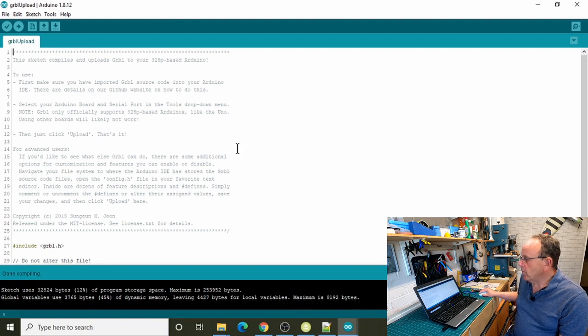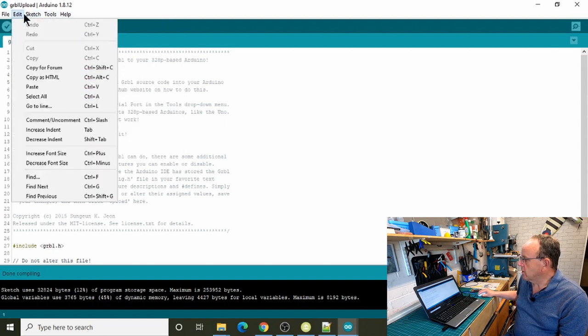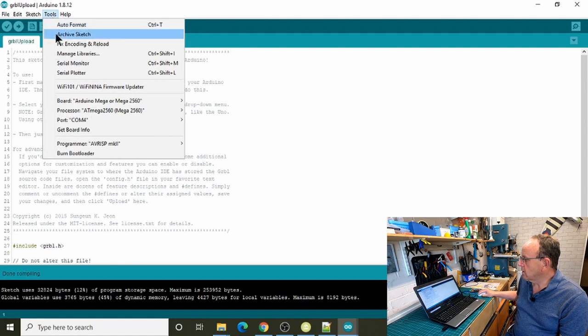So if you're happy with that, then all we do then is we just do the upload. So we now upload it to the Arduino. So this is where we need to make sure we've got the COM port. Where are we? Sketch. Get the right tools. Make sure we've got the correct COM port selected.